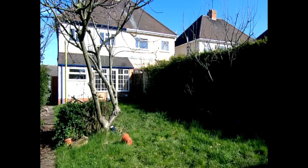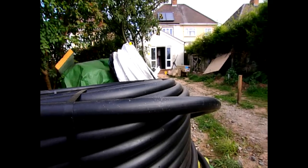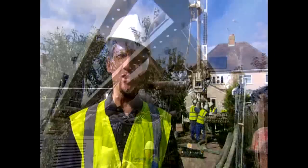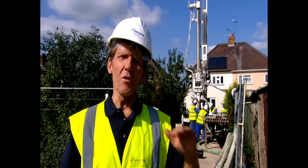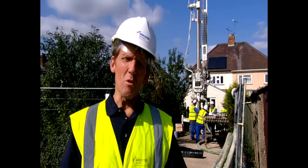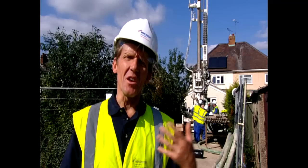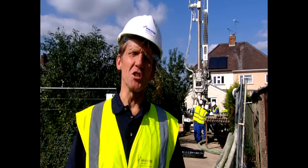In this garden with a limited area, instead of using the pipe-in-trench method, we've used a borehole for the ground source heat pump. This has involved getting a drilling rig in to drill 80 metres down into the earth below. We've had the geological survey done on the ground, so it's not a hit-and-miss operation — we actually know what's under the ground metre by metre. We know at what depth we're going to reach the water table and what's below there. That will extract heat year in, year out, all through the seasons, at a fairly regular 3 to 5 degrees centigrade.